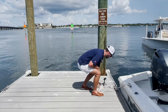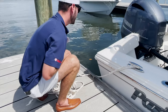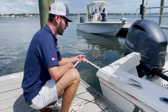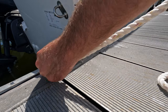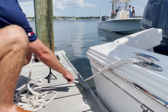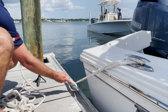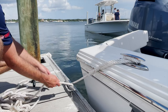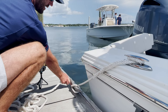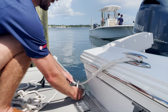Now for the dock side — I'm going to teach you a simple cleat knot. This knot will vary a little bit depending on length of boat, length of rope, and length of dock. I'm going to go around the far side of the cleat, away from my boat. From the side of the cleat on the boat side, I want to wrap around the farthest side of the cleat on the dock. Once I do that, I go around the bottom of the cleat again and make a full wrap. Now that I have a full wrap around both sides of the bottom of the cleat, I come up over the top and cross once over the top. Then on the second cross, I loop this underneath itself and pull tight.